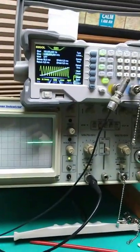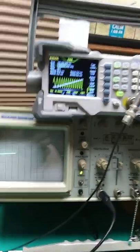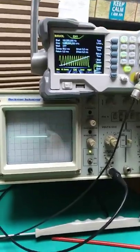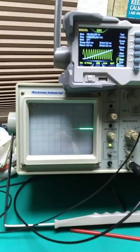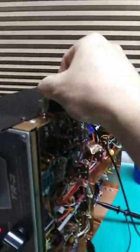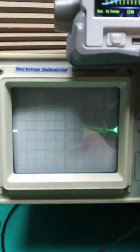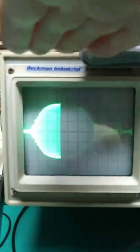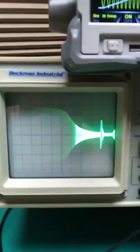So with the old test equipment — signal generator from 100 cycles to 3 kc — for a filter that should be about 2,100 Hz wide, we flip on handy, push the talk switch, and get a nice envelope: fairly flat across the top and bottom.